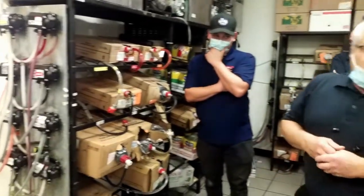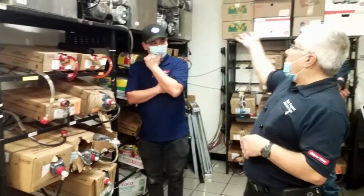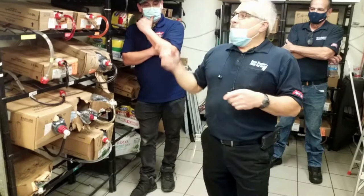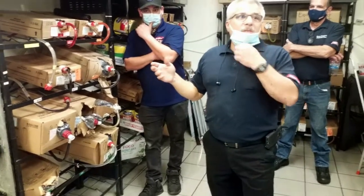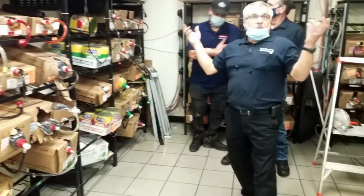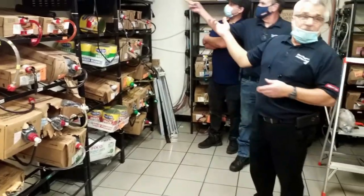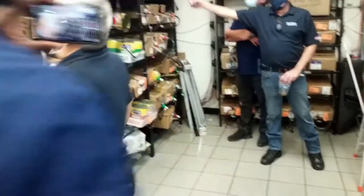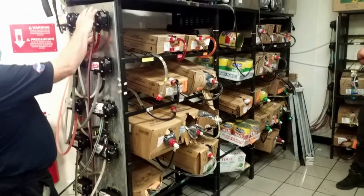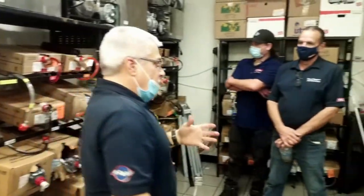These flow jet pumps fail because they get moisture in the air line. Because we use an air compressor. If we were to use CO2 pressure, which is a dry gas, on those pumps, they'd last forever. They'd last 15 years. So it's the moisture that makes them go bad, because we use an air compressor, which is humid. That air compressor draws in air and compresses it, and there's moisture in that air line. Guaranteed, if you open that valve right now. Well, you could take one off of here. Yeah, guaranteed it's watering. No, take the bottom one off. So that's why they fail, because of the moisture.